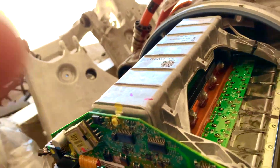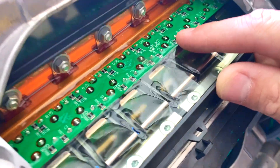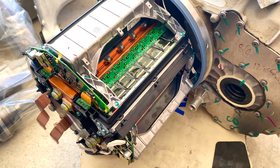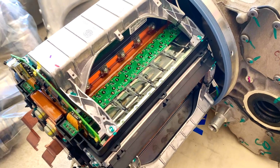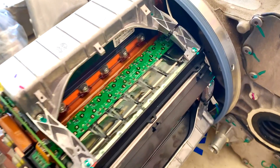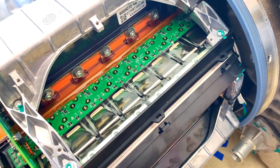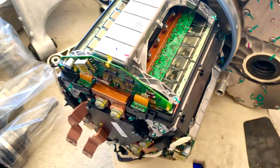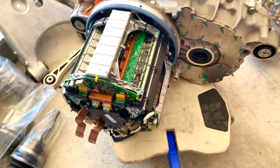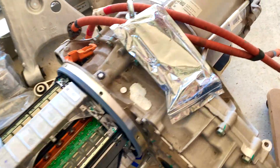There's a nice gel here — this is a conformal coating, more like a protection for the MOSFETs. Because these things get hot and cold, there's a lot of expansion and contraction. It's nice to have something flexible that can keep up with that — expansion, contraction, when you get a lot of current it expands, then it cools down and contracts. That's why they have this very flexible coating on top of everything.